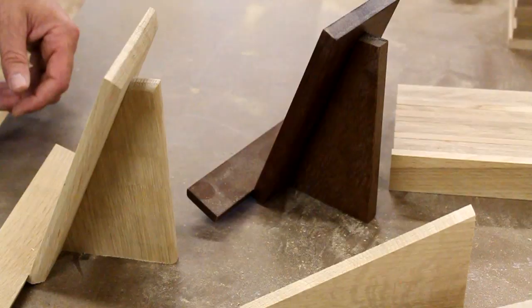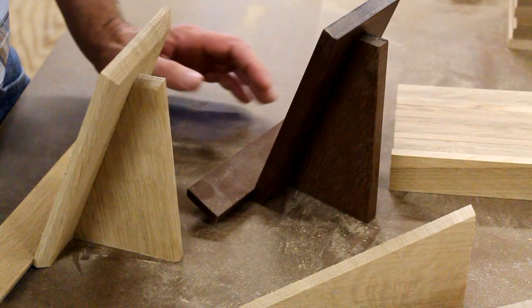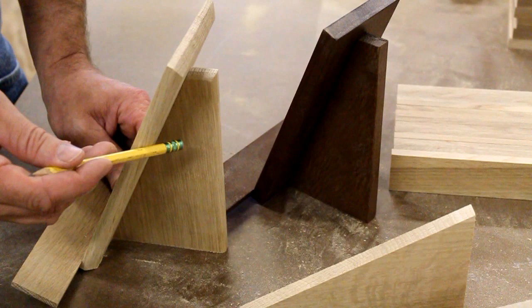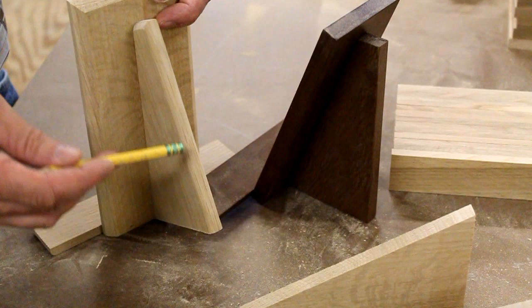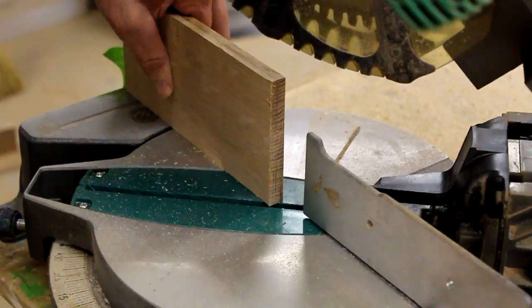I've decided to make a few changes to the original design. I felt the easel looked a little blocky, so I've cleaned up the edge by cutting a 45-degree angle — now the edge comes to about an eighth-of-an-inch point and then cuts back at 45 degrees. To get the 45-degree angles on the back of the easel, I'll first cross-cut with the chop saw at 45 degrees and then rip a 45-degree angle on the table saw.